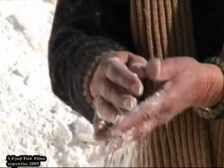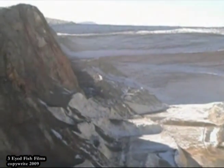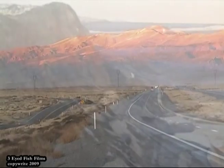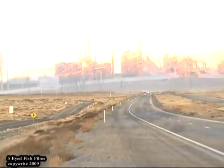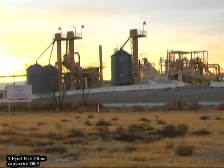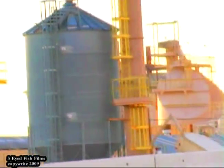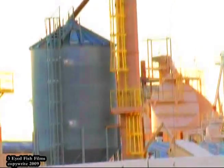It's critical to emphasize selectivity. You sample the diatomite based on uniformity, then take the sample to the analytical lab and try to duplicate the process it would go through at the plant. You classify it, remove contaminants such as dirt and sand, then the end product is mixed with soda ash and calcined at approximately 1,500 to 1,600 degrees to duplicate what the material would do. The finished product is then put through another air separation process.